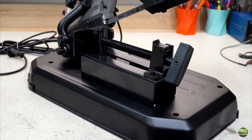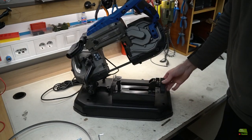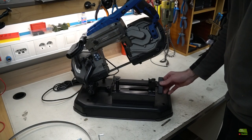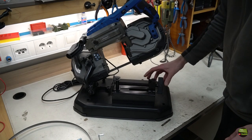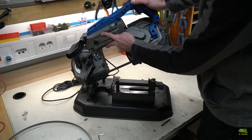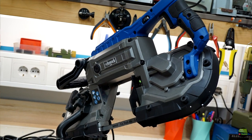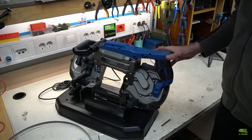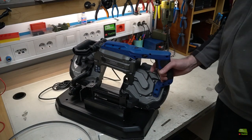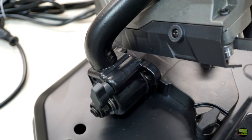The base is made out of thin metal and it's reinforced on the needed spots. On the corners it has 4 rubber legs. The vise is also made out of metal sheets. It has a quick release half-nut and one jaw is movable, which is not that good because you can hardly clamp a piece shorter than 10 cm, since the saw runs quite far away from the jaws. The saw itself looks quite solid because the entire motor housing, reduction gearbox, and wheel holders are made out of cast aluminium, so only the handle part and wheel covers are plastic. On top there's a switch for the LED light, from the side there's a trimmer for speed adjustment and a trigger. The saw base hinge locks in the upper and lower position, which can be annoying but still useful — I just missed a disable function.